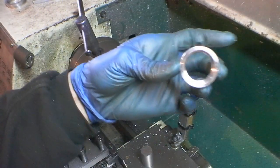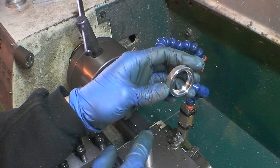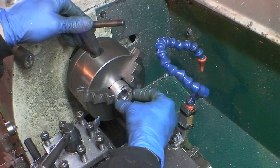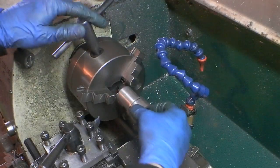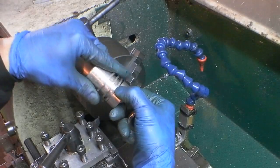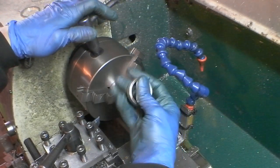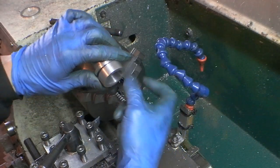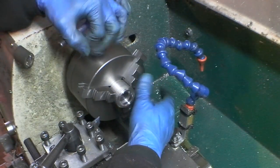The part that I used to machine a lot is this guy — very short, and aside from the outer face, every surface gets machined. I need to reliably place that into the chuck. I also created 3 little spacers here to vary the depth to whatever I need it to be. With 2 spacers, the tool on the face of that is Z0. Then I can place my part in there, and I turn the outside diameter down to just smaller than 1.5 inches, which is this. Crank it down — it stays in while I machine.